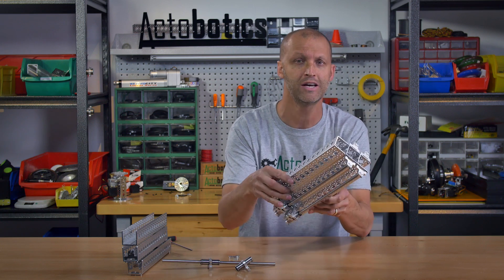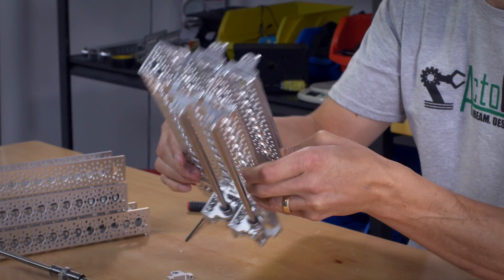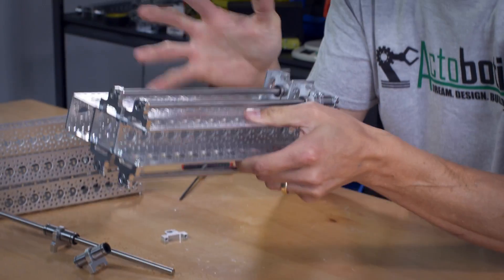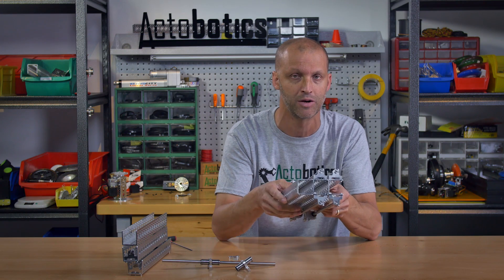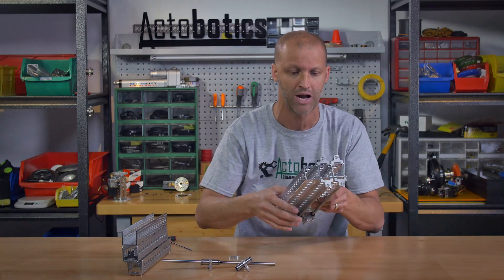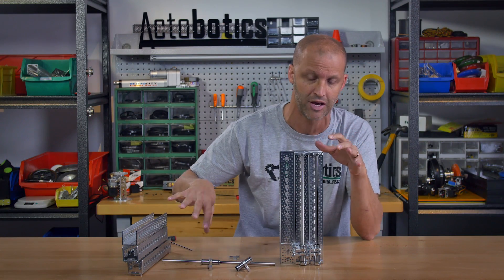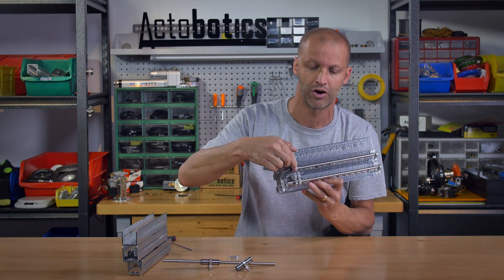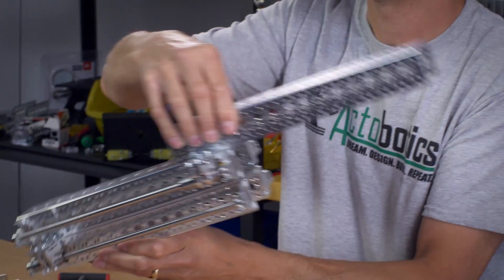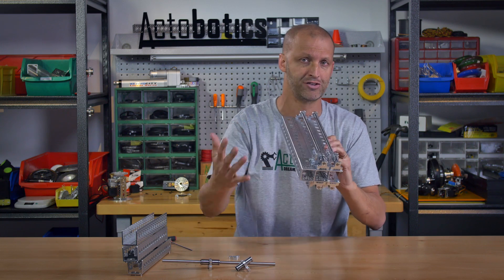Another example is this version right here that runs the linear ball bearings in parallel to one another, with a dual setup on either side of the channel. This creates a very smooth setup. The nice thing about running them this way is it creates a very rigid setup — there's actually no side-to-side play whatsoever — and it gives you the option to run your pulleys or various drive systems to extend or retract it. There are lots of different ways to run pulleys through the channel or externally. As you can see, we've got our double stacked 8mm linear ball bearings, our 8mm shaft clamp on the outside, very smooth linear action, and you've got the entire space down the middle of the channel to run your pulleys, gears, chain, whatever you'd like.